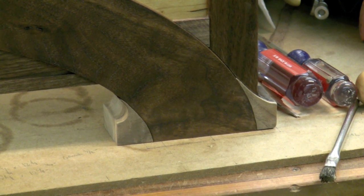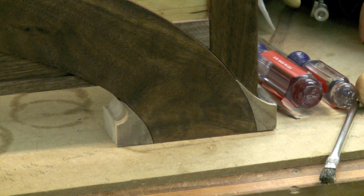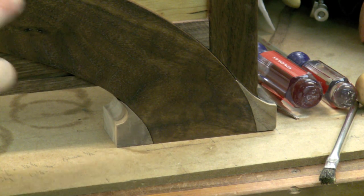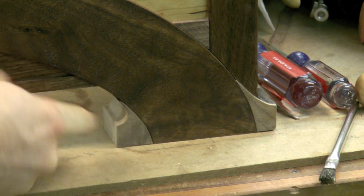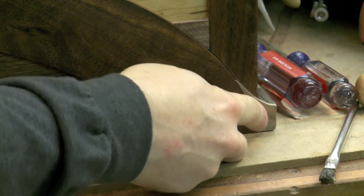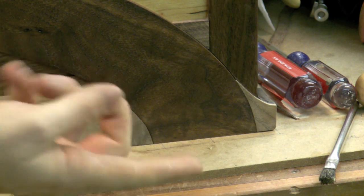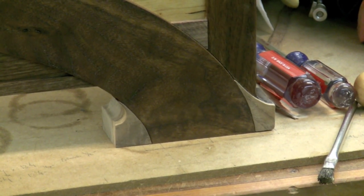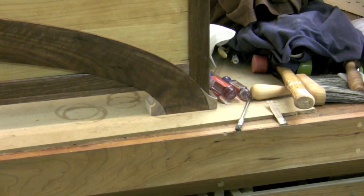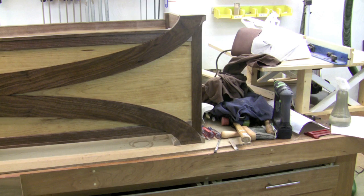I've got to finish those little parts up, but I had to sand those. Once the front was all together, I sanded to the profile I wanted and gave it more support, with some blocks behind. This curved part here is only about a quarter inch thick, so I have a big block behind here that's like 1.5 inches and a little piece here and here stuck on. These front pieces are from the same material as this. The back pieces you don't really see anyway, but they're from the other walnut. I did that top and bottom, got those pieces to the profile I wanted, and now I have to go through a finish process on those little sections to match them up to the finish on the rest.